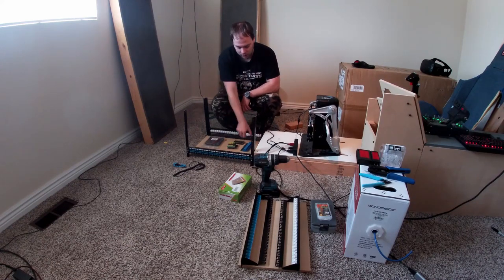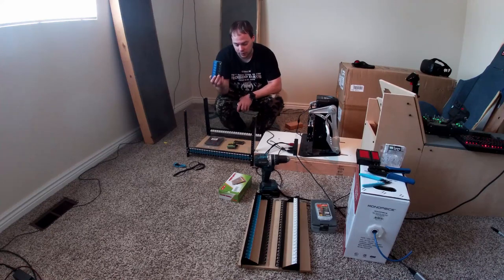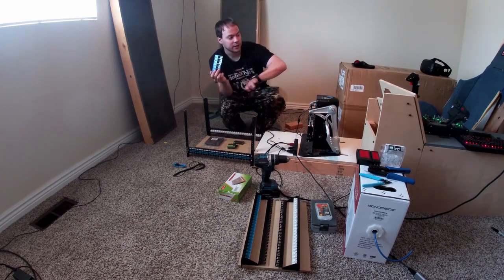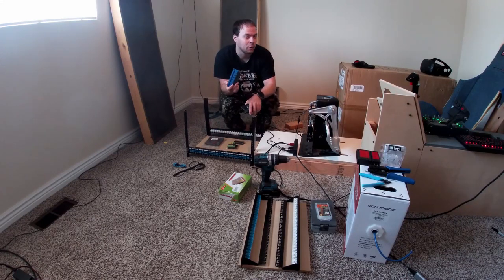We are going to take that power supply and ground it to this rail, so I can actually have a decent common ground. That way, this whole cockpit is kind of grounded and I can just clip on. But I do have to make sure not to hit the paint on these things - I've got to make sure I'm making a good contact with the outside, so I might have to actually sand the inside just to get some metal exposed.